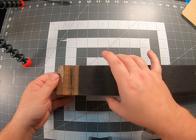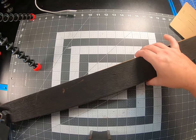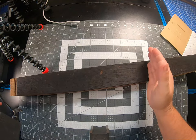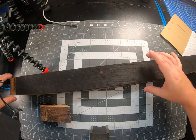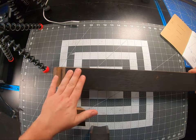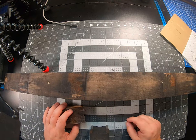The top stave was going to be worthless so I cut that one out. As you can see, the staves actually get narrower toward the ends — very little overlap at the ends but quite a substantial amount in the middle. Because of this, I wanted to cut from the middle out instead of chopping off one end or the other. In addition to this narrowing, the staves also had some curvature dead center compared to the ends where they were pretty flat. The stave itself also had a natural curve, and if I used one end or the other I'd end up with a lopsided effect. So I decided every stave had to be cut dead center with the ends removed from each side.